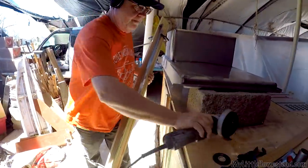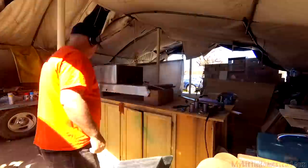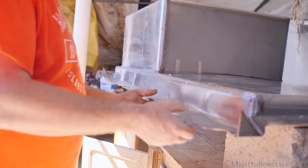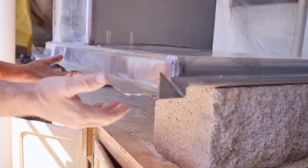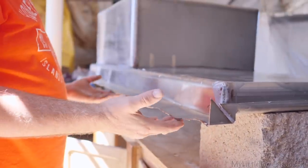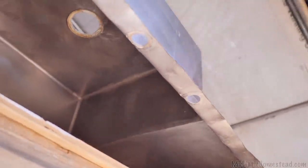The backsplash is a little bit high for the window that it's going to set underneath, so that needs to be cut off. That's all cut off, and it needs to be bent down so that I can run a windowsill right over the top of that sink so it'll look beautiful. I've got to cut and bend it, and then I'll probably tack something here on the sides. The wood that I intend to go over the top of it is from the windowsill — it goes right up to here. And then I'll just caulk in the backside of this.